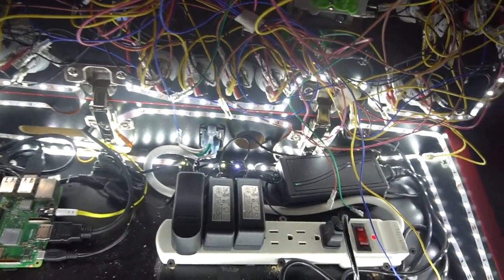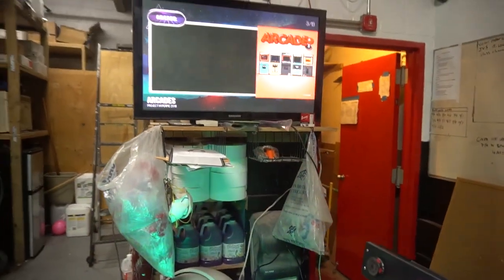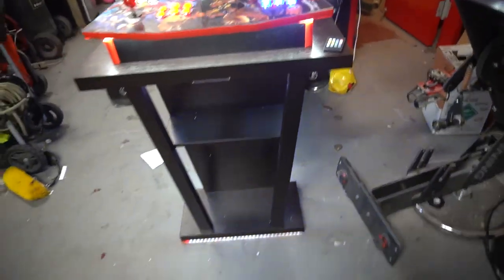Stapling LEDs is difficult, especially with RGBs. These are all stapled out. It's got to be tight. After a while, the stickiness of the LED strip will go away, but you have to be careful when you staple — you might go right through the RGB strip and screw up the entire strip unless you know how to cut it and solder it. There's so much trial and error to line everything up. This is the plug to my RGB strip — I had to make sure it's tilted correctly or it would have rubbed up against player two. Literally clearing it. Two-player cabinet, we are ready. It's gorgeous, it's beautiful. We'll be playing with Ryan's HyperPi image. Guy, come pick this thing up!